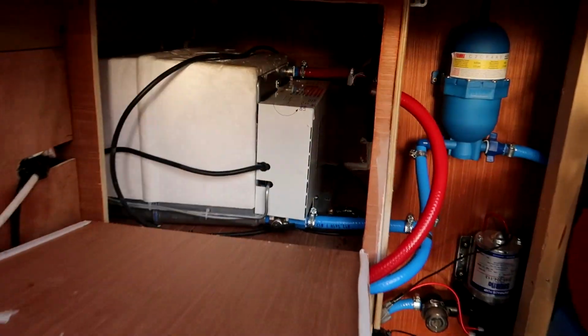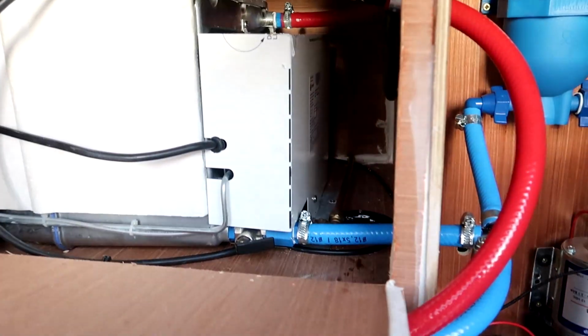And then yeah, the other thing is that there is a drop vent. So if there is a gas leak, which is going to happen at this joint, it goes through that hole there, it goes through this sealed tube and then out underneath the van. So again, everything is perfectly safe.